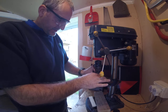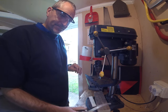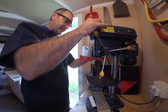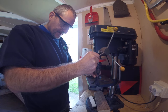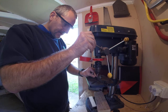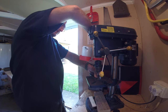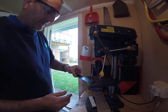There we go. So that's all I'm actually talking about — just a small dent, just enough to hold a little spot of cutting oil. There we go. And then I'll drill the rest of the hole. As I've said before, nice steady pressure — you should be seeing nice curls coming off. I will invest in some kind of drill clamp one of these days. There we go, so that's the holes drilled.